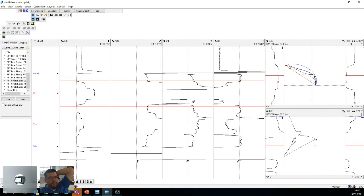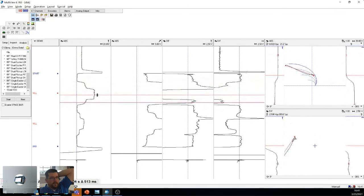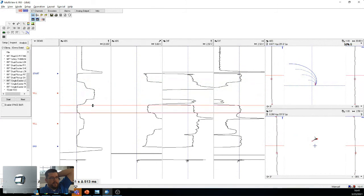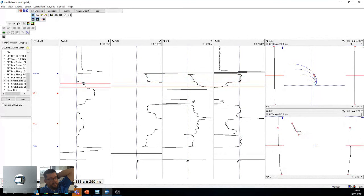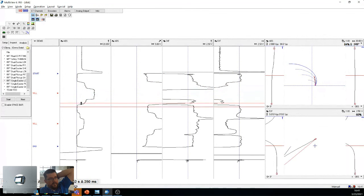This is when everything is under the defect or the damaged area, so it creates this dog leg, hind leg. And then when you come back out, the pickups are leaving the defect zone. Now your exciter is only there, and then everything's out. So this is what's going on: pickup, then pickup and exciter, then exciter, and then everything out.